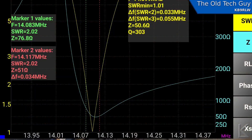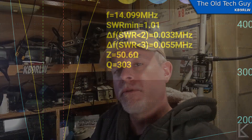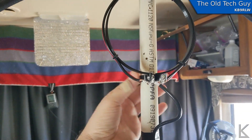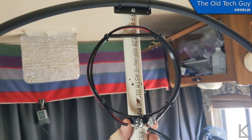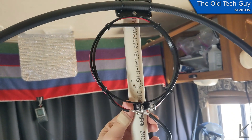And when I closed up the loop, wow — I can get it right down almost 1:1 now. It made a big difference. The other thing I changed is the coupling loop. I made this form and this clamp to go on the pipe. With my new former for the loop, I got this clamp on here and this plastic form for the loop. And I can shift it up and down, and I can rotate it within the plane of the main loop to assist in tuning. That adds a whole other degree of tuning and adjustability to the magnetic loop.